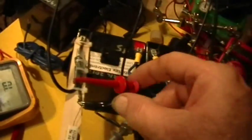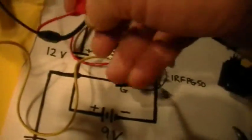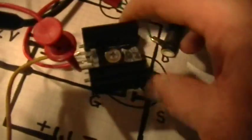And now I'm going to take the function generator output here, and I'm going to connect the black wire to the battery side of the current sense resistor so that the function generator currents are deliberately not included in the readings, right? This allows current through the function generator to bypass the current sense resistor, right? This is the quote-unquote wrong orientation, but it is the same orientation that Ainslie used for all of her data and all of her demonstrations until the latter part of the August 11th, 2013 demo. The red lead goes again to the source pin of the MOSFET, and the source pin has nothing else connected to it, right?